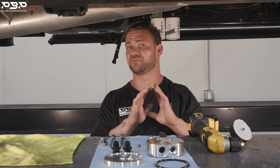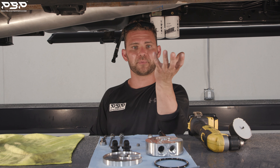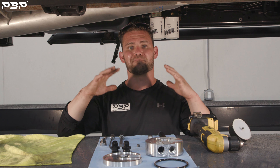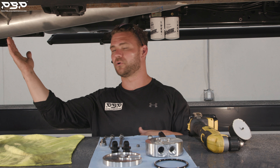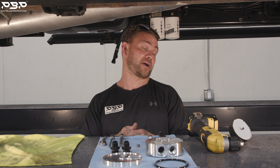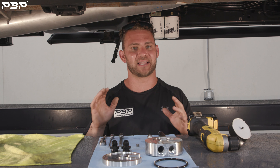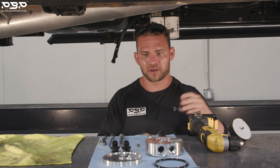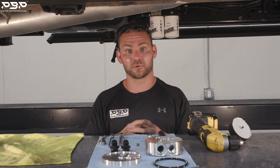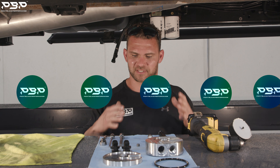The job of this sump is very simple. You drill a hole in your tank, you put the sump in, and gravity pushes down on all the fuel. You're making the maximum amount of power from full to empty. You just got to run out of fuel, then you ain't making no more power. That's all there is to it. We've got all our contents laid out, our tools, our hole saw, our baby Pac-Man sump. We're going to go over the individual tools, show you what they do, and then install it. Let's dive into it.